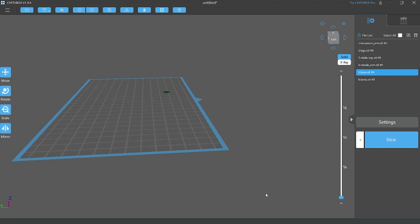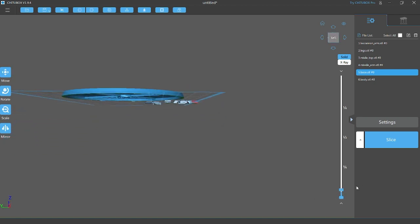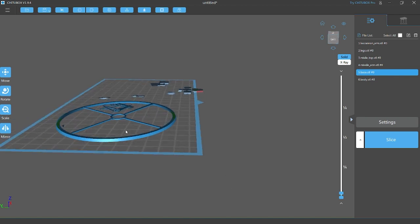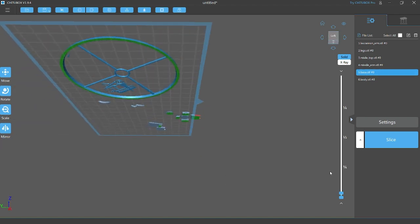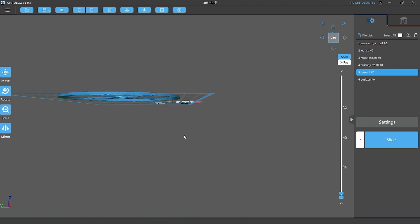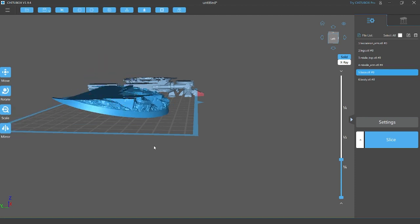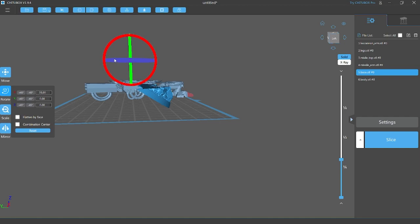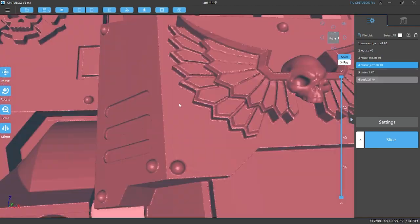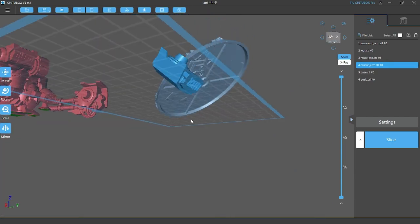If you take a flat piece and run it flat, all the supports underneath are being loaded all at once — this causes big issues. The first thing you'll want to do with flat surfaces is think it just makes sense to lay them flat, but it is terrible for your supports and will yield a poor final print. Even a little bit of angling goes such a long way. We're going with a nice 45-degree angle.